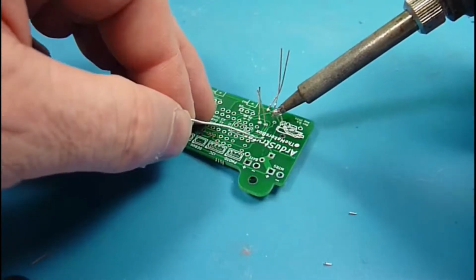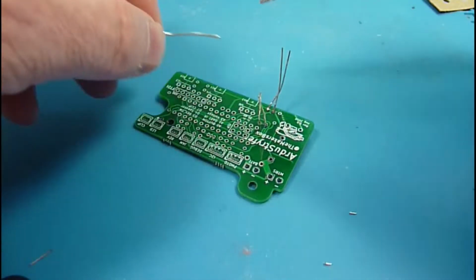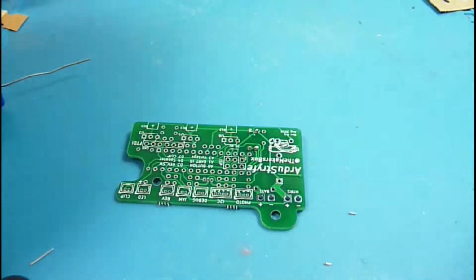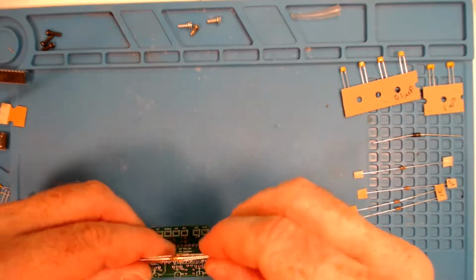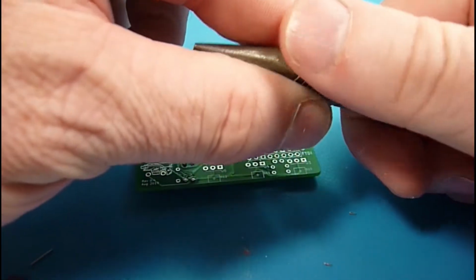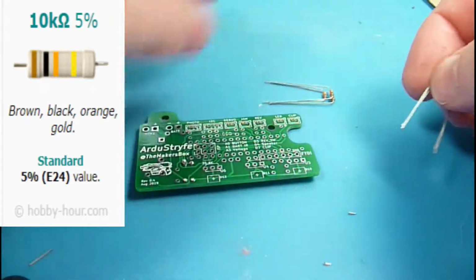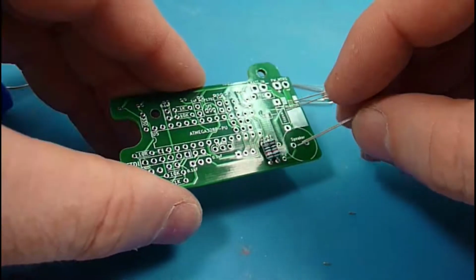So this is not going to be a how-to-solder video. I'll put some links in the description for some of my favorite ones that show the close-up soldering better, but in general, keep your iron tip clean and hot, and you want to heat up the pads and the leads at the same time. And you'll see, if you get temperatures right, the solder will flow and tent. It's using capillary action to pull itself into the joints, which is kind of amazing to see. I always like starting with the resistors because they're a little more heat tolerant as you bring your iron up to temperature, and kind of like pancakes, the first couple are a little tough, but from there we'll go on.